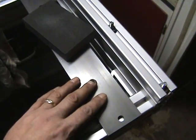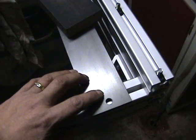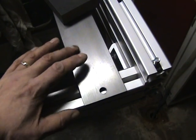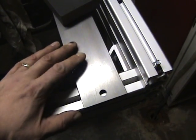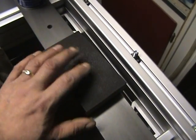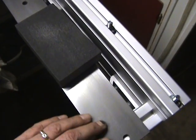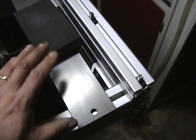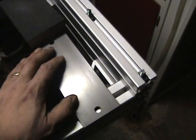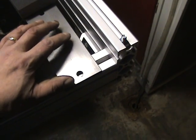One of the things I did with the steel — this is 1020 steel — these holes were water jet cut so it has been exposed to some moisture. There was of course some scale and some dirt on it, which is typical of getting steel. So what I did was I got one of these little foam abrasive pads, the fine grit, and basically wiped the dirt off, then just by hand went across it to take off any ferrous oxide that was starting to come up and any other loose scale left on the steel.